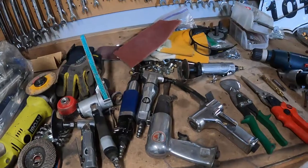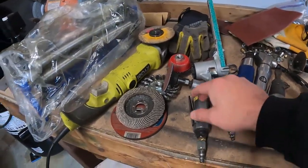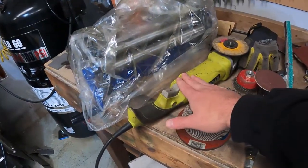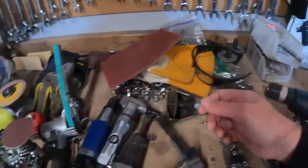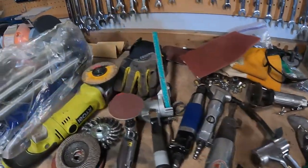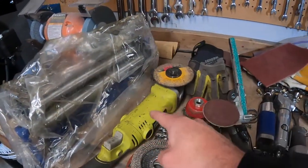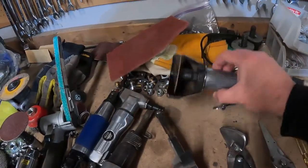Let's move into how you can cut metal. You've got a cutoff wheel and a die grinder, or you can use an angle grinder with an electric drill attachment — but I don't recommend the drill method. The blades are very thin and if you twist it while cutting, which is easy to do at a 90-degree angle holding a drill, you can shatter that disc and really do some damage. An angle grinder has a lot more power and is actually built for it.